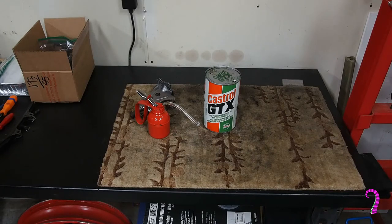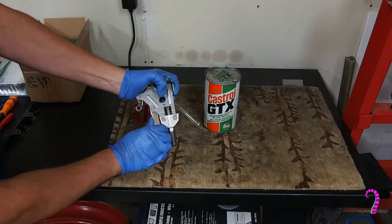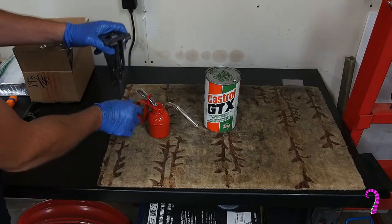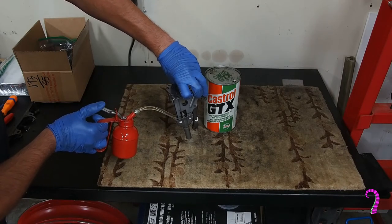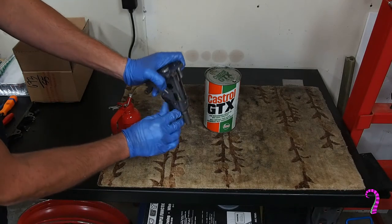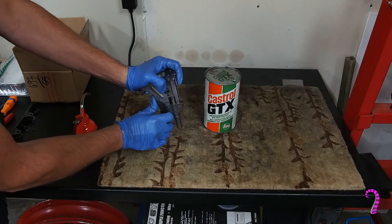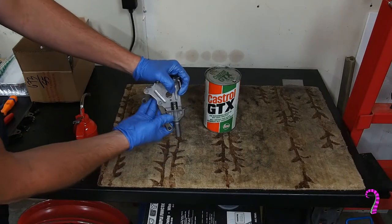Fitting a manual CCT is a relatively common mod, but to my knowledge this one hasn't given us any trouble so far, and here's how we make sure. With the CCT empty, locate the tensioner spring and pull back the arm to check the tension — should feel firm and motion should be gradual. Then we fill the chamber with oil and fill up the plunger by pumping the arm a few times. Once it's full, try to yank on it and it should lock. If it passes this test, then the mechanism itself works.